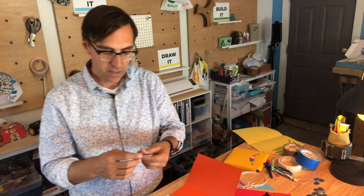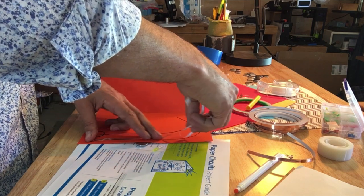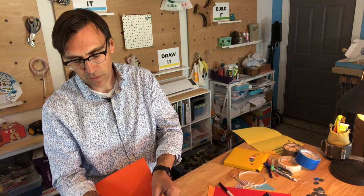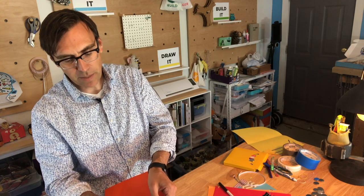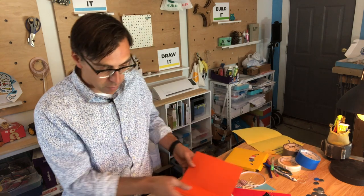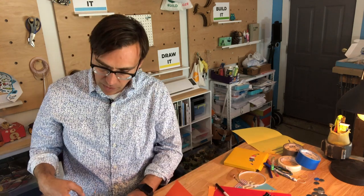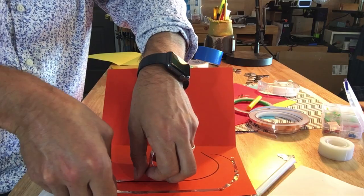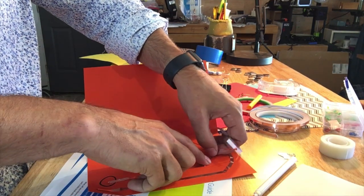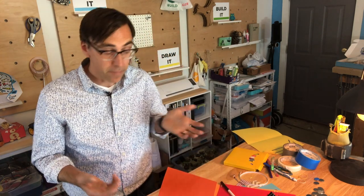Let's add in some copper tape. Copper tape is tricky stuff, so be careful with it whenever possible — try not to break it. Instead of ripping and cutting new pieces just to make a curve, just turn it around and make little bends in it, keeping your copper tape all as one piece so it is a nice uninterrupted wire. Breaks would cause what we call a short or a break in the copper. Nylon tape is a little more forgiving — you can stick the top to the bottom, break it a little more, and it works. If you're having trouble with copper tape, you can use nylon.